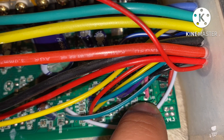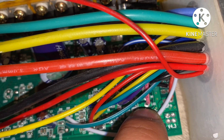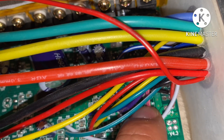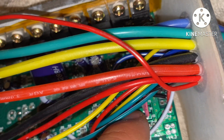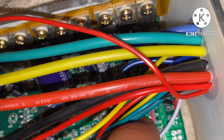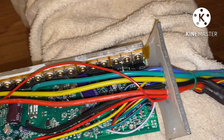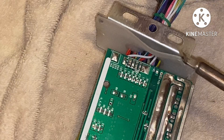On this controller it's L0 and L1. L is for low, H is for high. What I'm gonna do is ground the gray wire — I'm gonna bridge a ground to this gray wire and that's gonna activate my third gear. So in this case my high speed is going to be activated by grounding that pin.